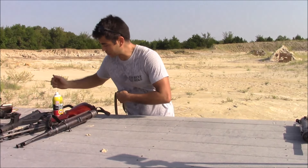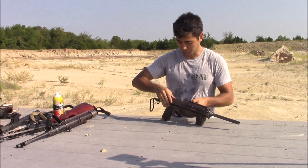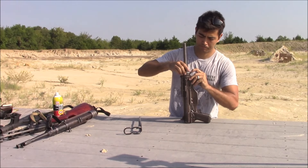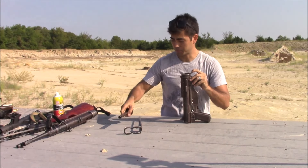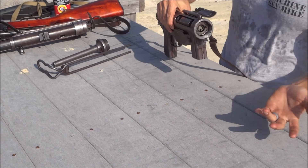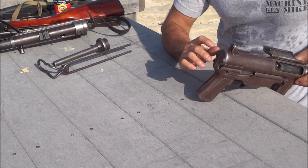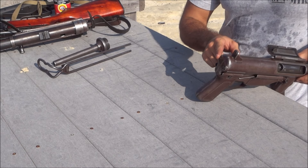Next up we have the grease gun, the M3A1, and mine does take a little bit longer to break down. First, let's remove the stock — which also doubles as the barrel wrench. There's the barrel, super easy to remove. Now on a normal M3A1, I'd be able to lift the dust cover, pull the trigger, and the bolt would come right out the front. But I'm using a different style rear guide rod plate. The later M3A1 guide rod plate — you can actually see the indentation of it here in the receiver, and there's even a tiny crack on the receiver.